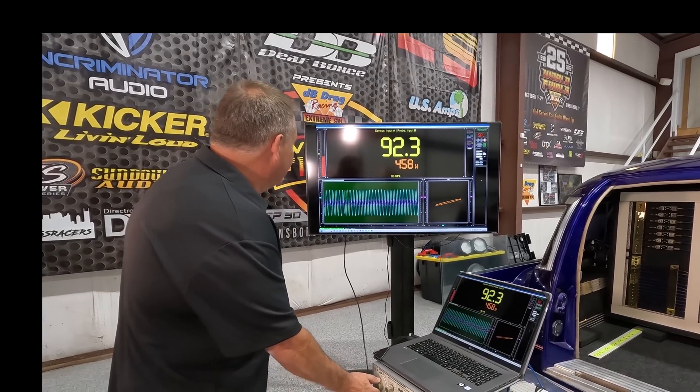Let's see if we generated any heat. Yes, we did — we could definitely cook something on this resistor. Let's see how hot it is. You can see those resistors, they're really smoking — 151 degrees right now. All that energy is being delivered to these resistors.